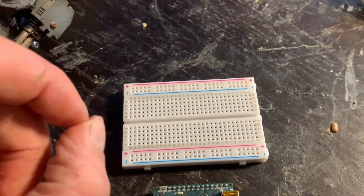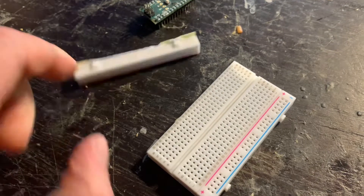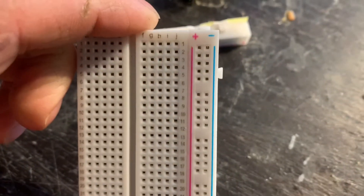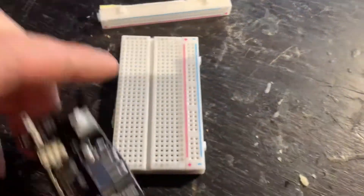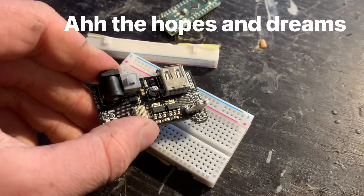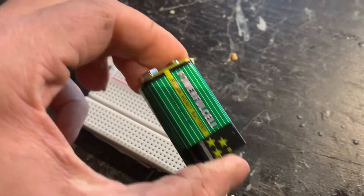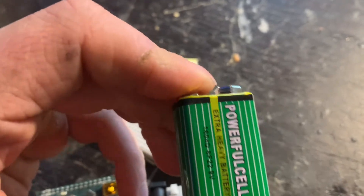The wires from the sensors can just plug straight in. The standard breadboard is slightly too big so I'll have to take off one rack. Thankfully it's easy to take off the end stacks of breadboards — you can also make them wider, thinner, longer and clip them together. This way we keep the rail for all the power, positive and negative. We'll also be trying to use a power distribution board from the Arduino kit, so we can plug it into the breadboard as well as having the Nano plugged in, and then try to run the entire tank off a 9-volt battery.